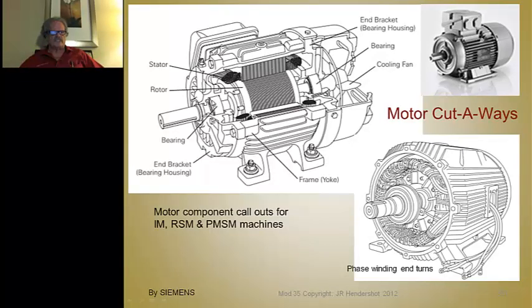When you have a motor with a pulley or gears going into a transmission, there are big side loadings on the shaft. These shafts will fatigue and can actually break right at the keyway. The side loads will cause the outer race of the bearing to skid and rotate at a very low speed, galling the bearing bore — especially if it's an aluminum bearing bore.